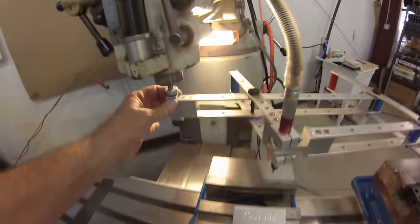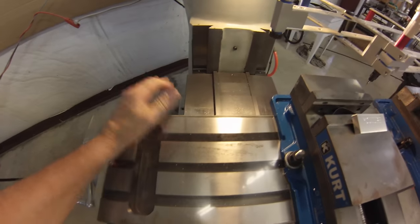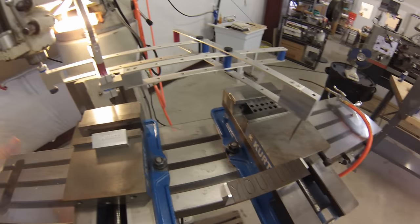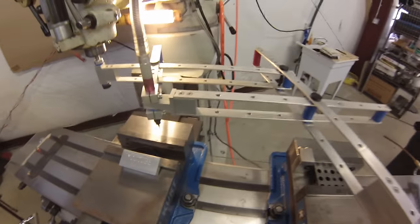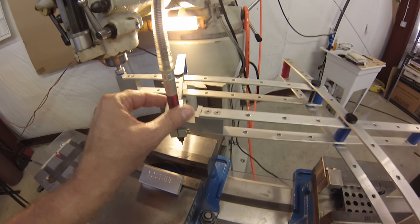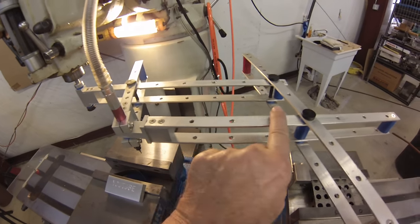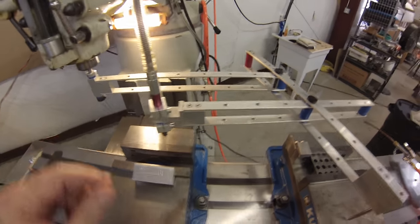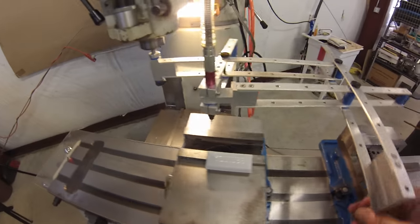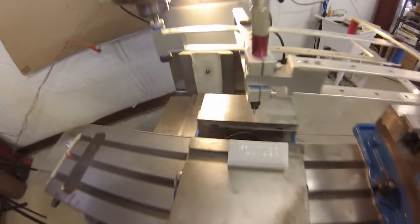Okay, the spindle of the machine was not turned on for that, and if you want to make some outrigger over here on the side of the machine that projects up and has the pivot point out here so you can center the table a little bit better, that's up to you. On my setup, my air grinder is always on the pivot point. Sometimes on other pantographs it ends up in here somewhere, but for my application it was just easier to keep it out on the end. And you can see how it works. It sweeps real nice, and whatever you're doing out here translates to over here.